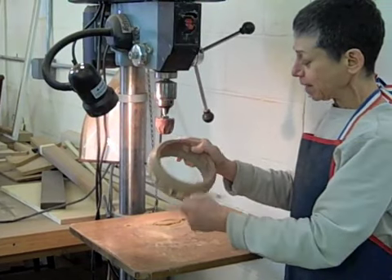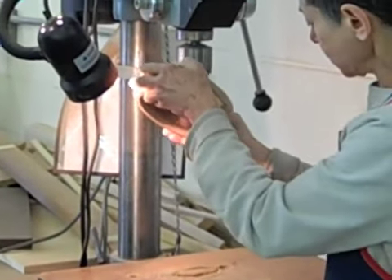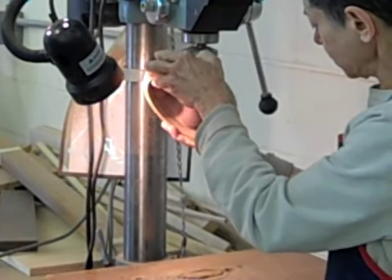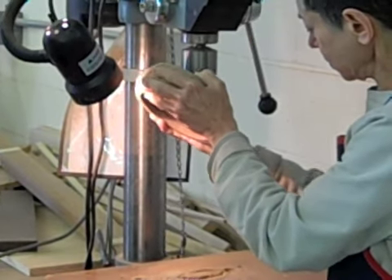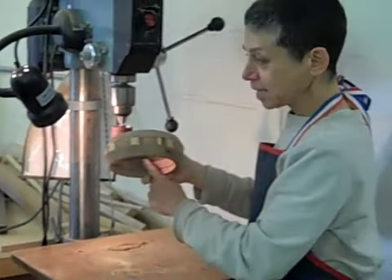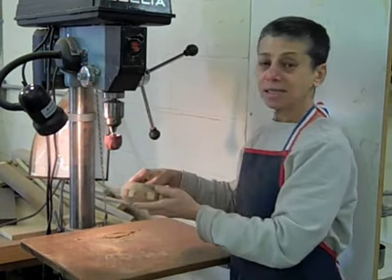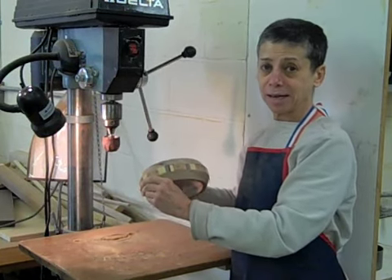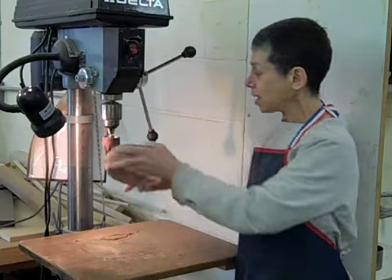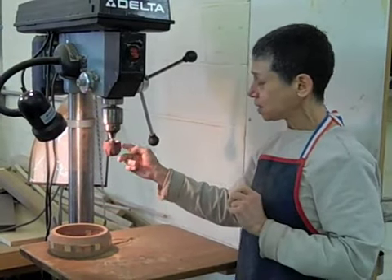Last night I glued this up, and what I'm going to do is get this smooth by manipulating it both ways. Once this is sanded smooth, I'll add another ring and then sand that. This bowl just needs another ring and then a base, but you need to go little by little, or you won't be able to reach. If you rush, it will hit against here and you'll get some nasty marks.